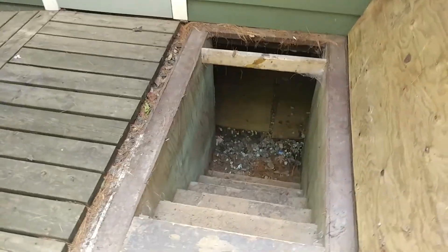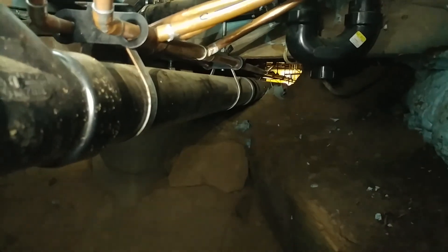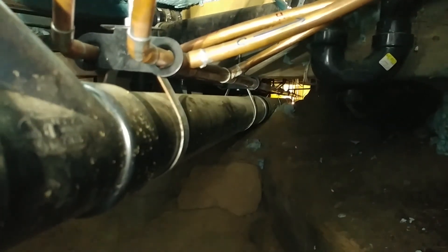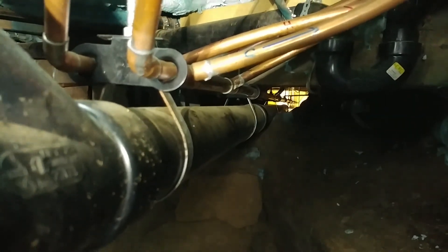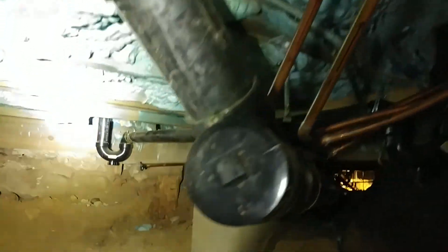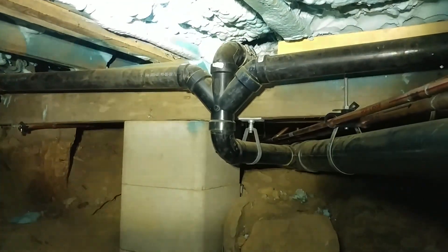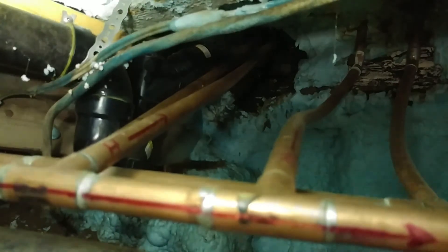This is the far end of the cottage in the pit. Here's the drain that comes all the way from the mechanical room — just one straight shot. We have a clean out, toilet, and that's our shower. Here's our double Y: our kitchen is up there and we have the laundry. All these water pipes had to slope downhill, down and out.